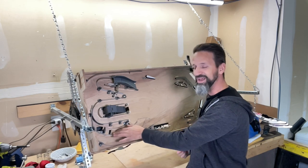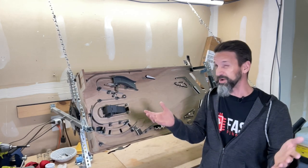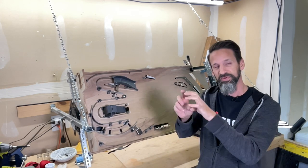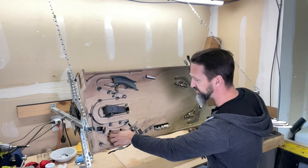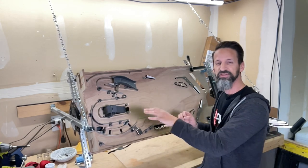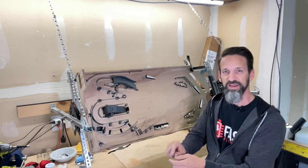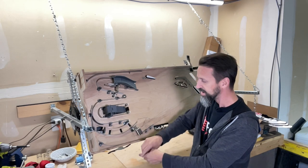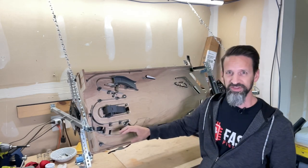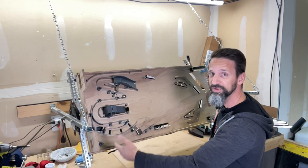That means we're going to actually be altering these slightly from how they are currently on the playfield. We've got to measure where they're at currently and put them into Fusion 360. My thought is: we'll go through and measure them, transfer that into my laptop on Fusion 360. As I'm doing that, I'll notice something like - this is 60 millimeters, this one's 57 - and I'll make them all 58 or something like that, making it a little more precise and uniform. Then since it's going to make some differences, I'll come back through, re-verify them, and really visualize and make sure I'm not moving anything that's going to run into a ball guide or cause other problems. Double, triple check those tweaks. Once we have all that, we're going to cut out another playfield - white wood number three.